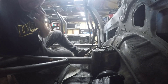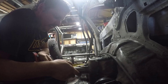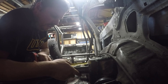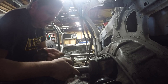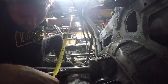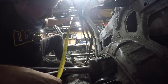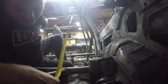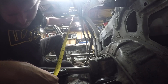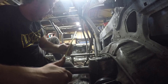The notching and all should be pretty straightforward because it should be straight - I tried to make it all straight. I'm going to come out four inches. So from center of notch to center of notch I'm going to be 40 and 3/4. I'm going to say it's 40 and 3/4 center of notch to center of notch. That looks about right, so I'm going to cut it to 42 and a half - we've got plenty of extra.